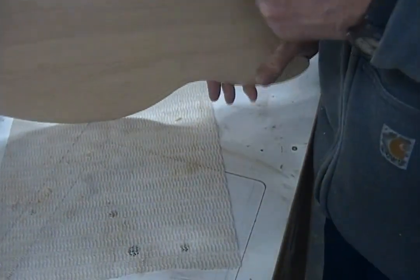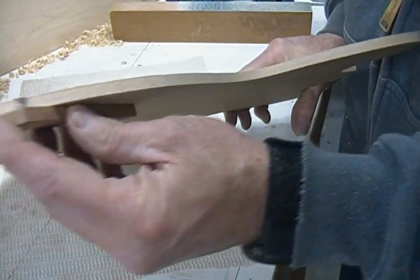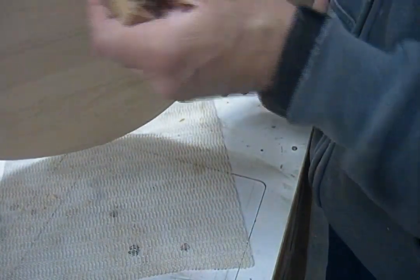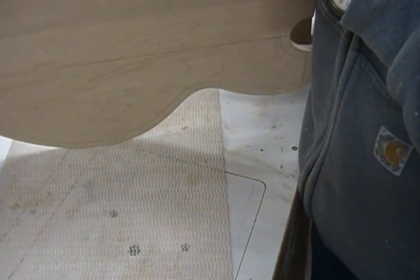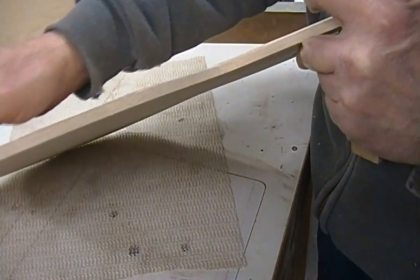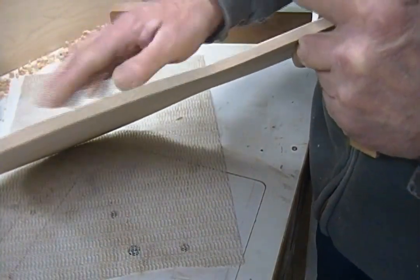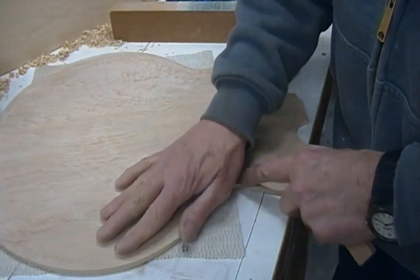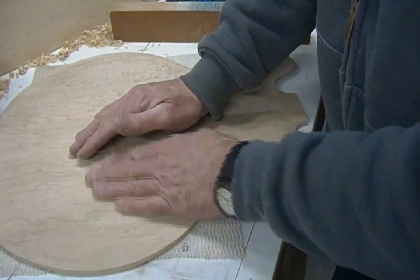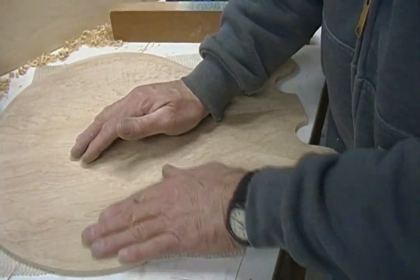And like I said, I just set it at a quarter inch, and then I ran around the whole guitar top and scored it. So I can see exactly what I have left. So I have a pretty good line that I'm going to end up planing that down to all around the perimeter. I've just been working inside the perimeter, and I've got a really slight dish right here. By the time I get this worked out this way, and then I take this down to the line, it's going to come down right smooth into it.